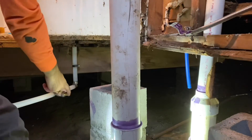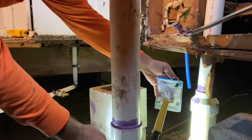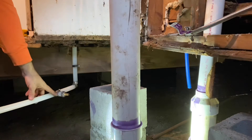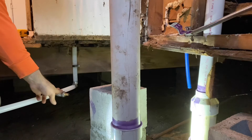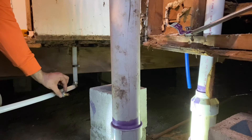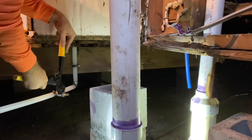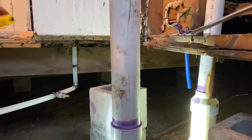I'm going to crimp this reducer on here - it's three-quarter inch to half inch. On this piece I have a little tiny strip of three-quarter inch pipe with two crimp rings on this T. I've cut the main line, put in a T, crimped it with two crimp rings and a little tiny short stub of pipe right here in three-quarter inch so I can connect to the three-quarter inch and go down to the half inch. I'm going to tighten this down. Now that's tightened down, we need to measure.